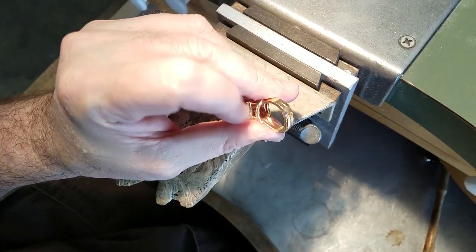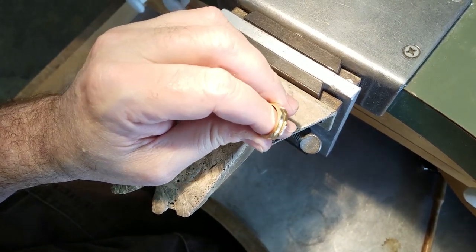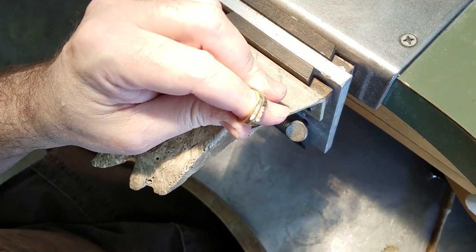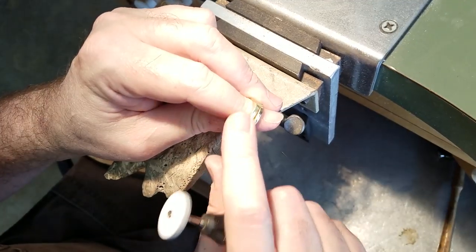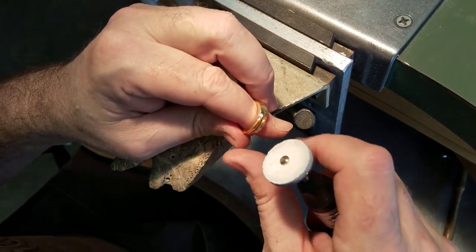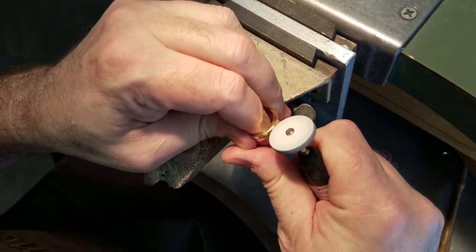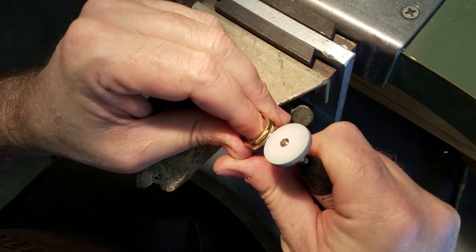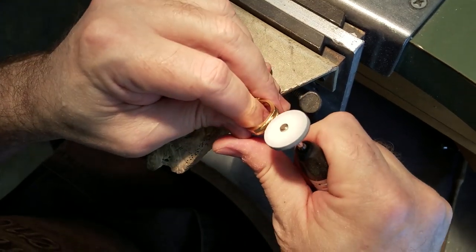Here's something I do that I don't usually even think about — I just do it. I keep my finger on the ring because one of the things I don't want to do is heat this ring and let it cool repeatedly, because that's going to harden it. So when I get to the point where it's hot on my finger, I back off and let the ring cool just a little bit. If I'm in a big hurry, I'll get some water and just dip it. But typically I'll just let it cool a second, then switch to the other side.